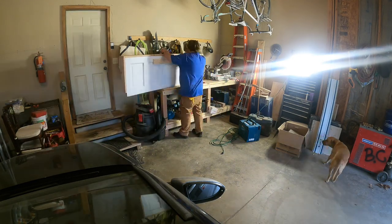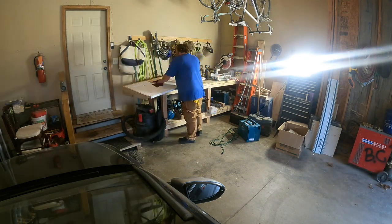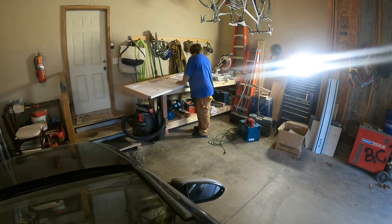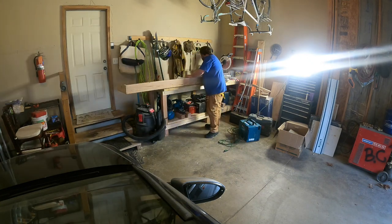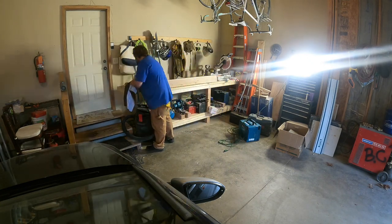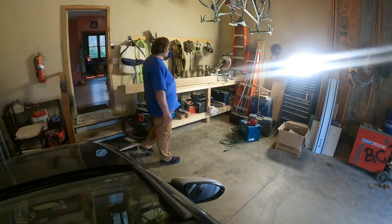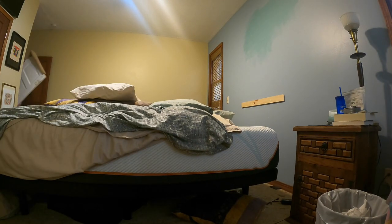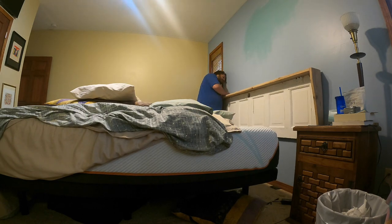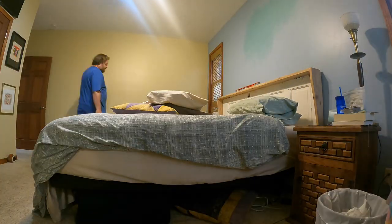No creaking, no noise, nothing like that. I always mount headboards to the wall, especially with the French cleat. You can space them out from the wall — it looks really nice. I end up putting backlighting behind this one with a remote control LED strip, so you can have white light or colored lights or whatever you want. The reason I mount headboards to the wall is it stops them from squeaking. If you mount headboards to the frame, unless you have a super robust frame — and this bed is actually an adjustable frame, so there's no way to mount a headboard to it anyway — they just move, they squeak. So mount them to the wall, use a French cleat.